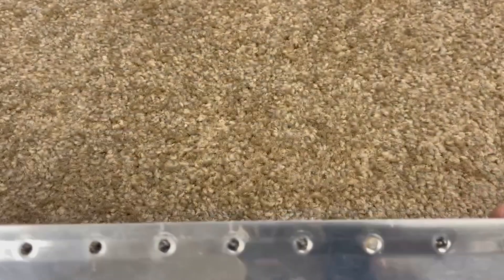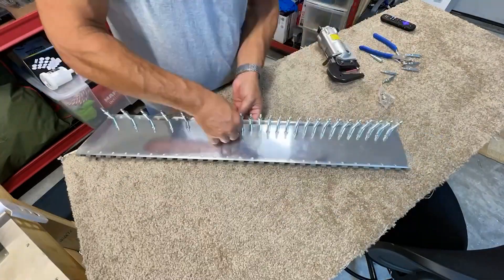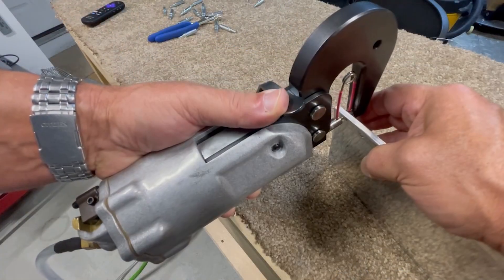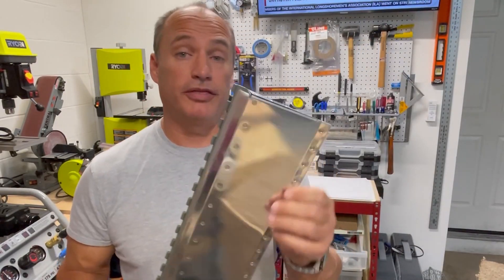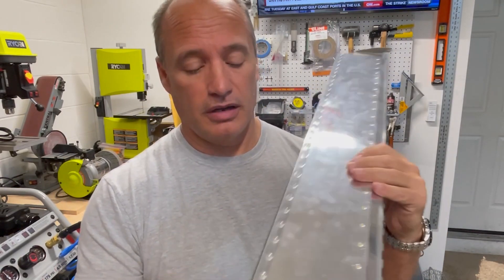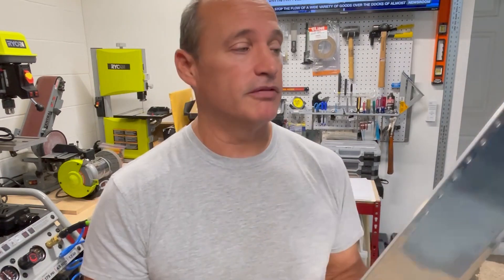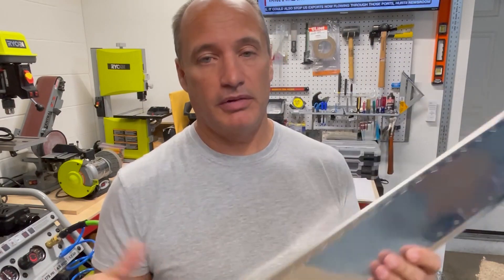As you can see, the shank of the rivet will never completely fill the dimple, but it is flush. Vans recommends putting the manufactured head on the top of the elevator and the shank on the bottom where no one will see it. I move on from there and set all the other rivets in the trailing edge. That came out really good. I think the tool works really well. The dimple die produces a pretty nice result - I don't think I could have done any better back riveting it, and it's definitely a lot more consistent and the process goes a little bit faster. So for $36, yeah, I guess it's worth it. But it certainly could be done without it - I think it may just be an easier process.